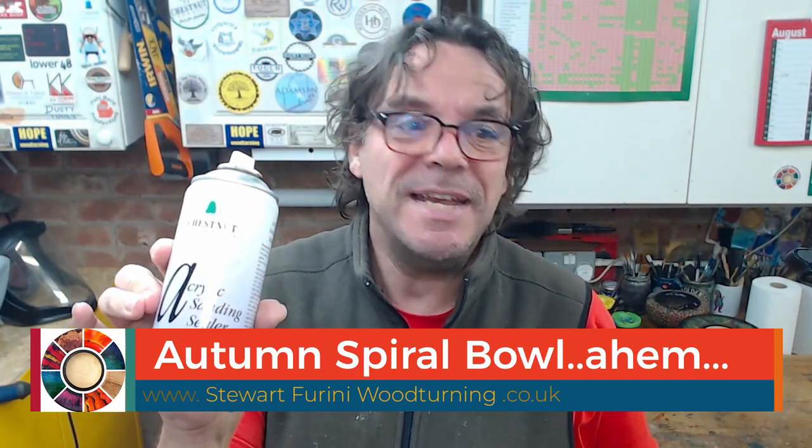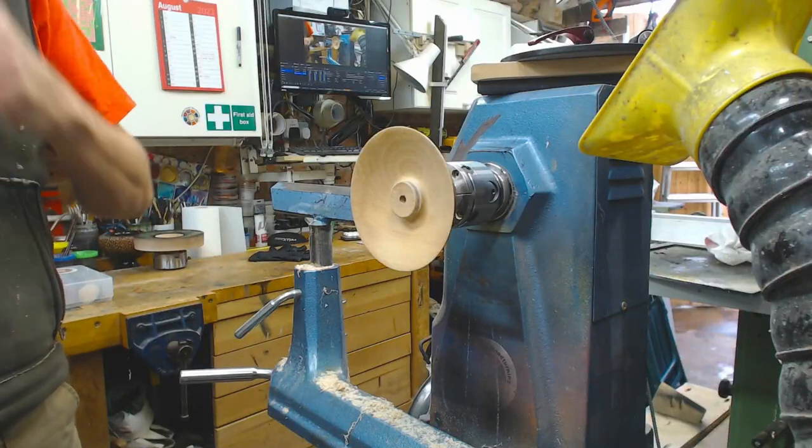Welcome. I've just been spraying some acrylic sanding sealer on a little tiny bowl that I've had turned and sitting on a chuck for months. I am actually breaking the rules with this one because I'm going to use some spirit stain on this little bowl to liven up the rim. Usually you'd put stain on bare wood so it soaks in and changes the colour, but I'm going to use it for puddling — trying to get a nice autumnal feel, maybe something muddy. Let's see how I get on with this messy experiment.